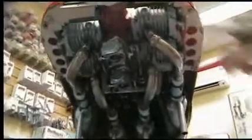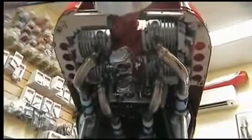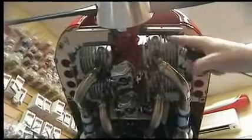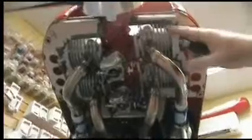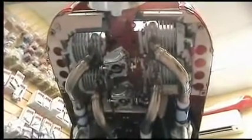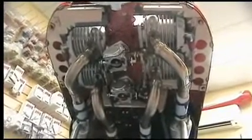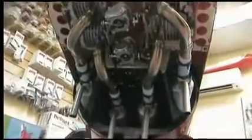Off at the business end of things, as you can see, the DA200 is a 4-cylinder. This is one of the magnesium versions. It's got the magnesium crankcases with milled down cylinders, so they get quite a bit of weight off a standard 200. This one weighed in at just over 4.2 kilos, 750 grams lighter than the standard DA200s, which is quite significant. As you can see, I've got 4 KS86 canisters fitted throughout.